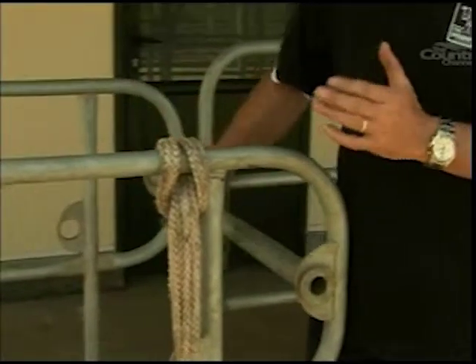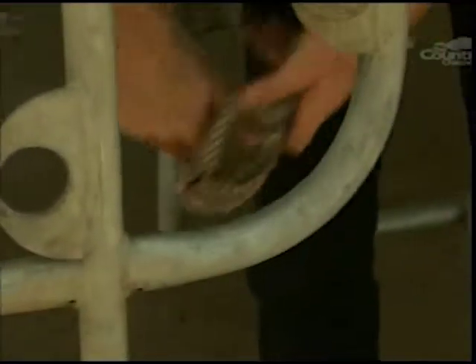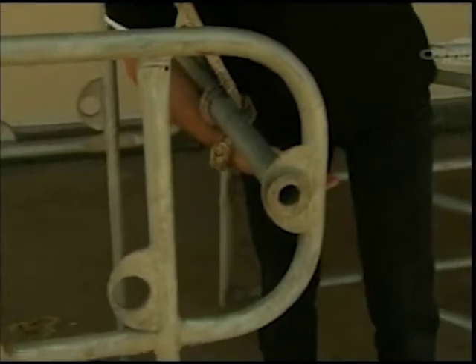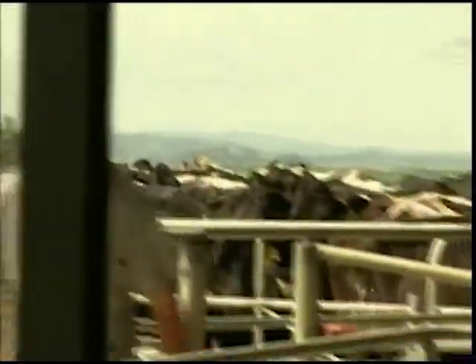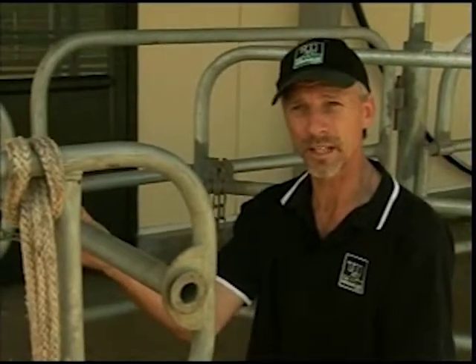Talk me through the use of the belly straps, the winches and the supports — how does it all work? Basically, one of the key features is the back leg bar. This rope gets winched onto that and wrapped around this bar, so when that rope gets winched up with the handle, that back leg ends up getting pushed and held up against the bar. The farmer can then literally look at the cow's hoof from this angle, knowing that she's not going to belt you because it's well and truly restrained by that bar.